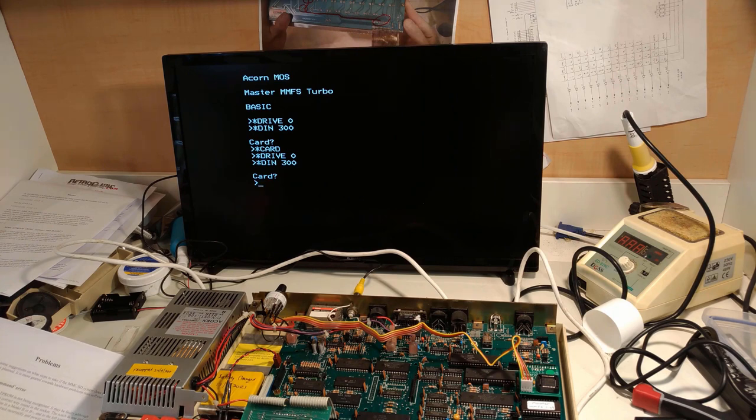Here, in order of simplicity, are some checks to carry out. If supplied, turn the 20-way ribbon cable around so the end that was plugged into the interface is attached to the user port connection and vice versa. Not applicable, Model B owners, not applicable. Suggestion about user VIA being potentially faulty. In the case of the Master and Model B, the user VIA is usually soldered in place. It could still be faulty, but changing it is clearly much more work. I really don't feel like doing much more work.